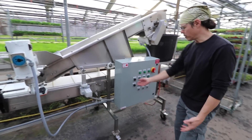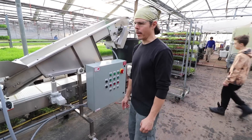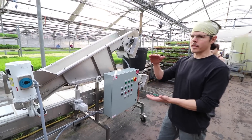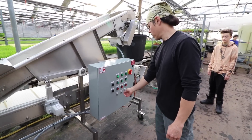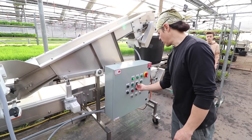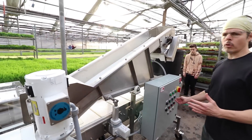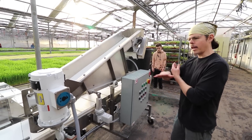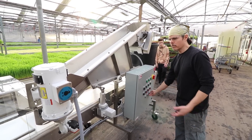Controls are super simple — blade up and blade down. I've already set the blade height. You set it for each crop — I tend to start with the crops that need the highest blade height first and then just work my way down. I'll set the speed for the in-feed and then the incline. I don't want things moving too fast because it can pull the plant out of the tray — I just want it to cut and then fall onto the belt. I tend to have the blade going pretty much full speed.